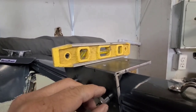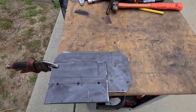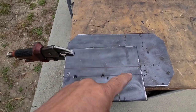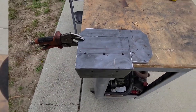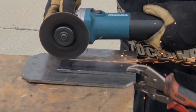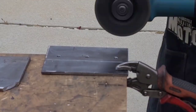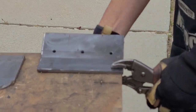I can still play around with adjustment here. These holes I drilled out for a quarter inch — I'm going to oblong them a little bit, stretch each hole out just a bit to have enough room to wiggle this plate around. I already drilled out three holes for my mounting point on the Versatrac. Since there's so much meat left right here I have to remove it — I drew a line about an inch below these holes, so I'm going to cut it off right now.